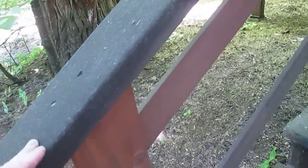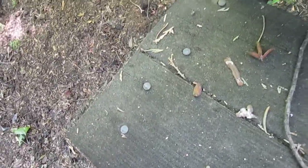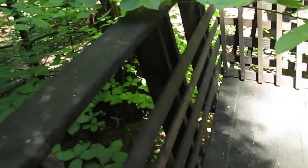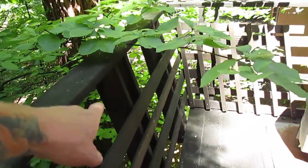What we basically do: pressure wash, bleach, and sand on some of these. We try to get this as nice as we can. We knock it down, then we reset a lot of these nails. A lot of bleach on this one — it's definitely gonna need it. And then we come through any areas and just go through.